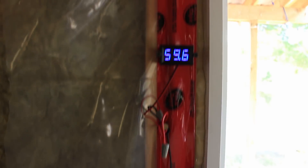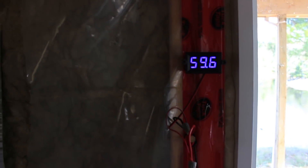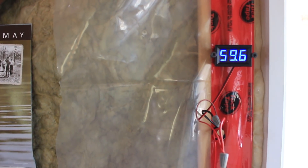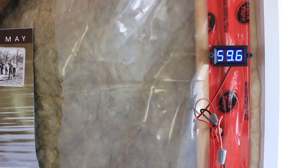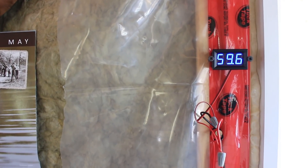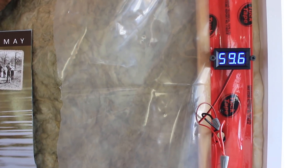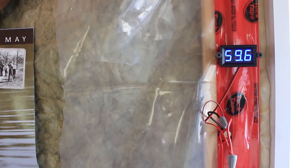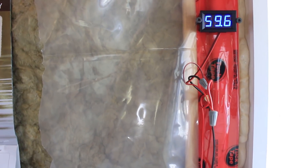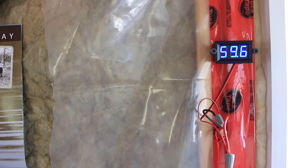One last thing I wanted to show you guys — I wired up this voltage meter I bought off Amazon. I got tired of running outside all day or all night just to check the voltage. Now I can sit here inside and see it. It's not the be-all and end-all of how your batteries are doing, but it's a good indication of where you're at and how much power you have left. We're sitting at 59.6 right now. The battery voltage will always show a bit lower than the charge controller voltage — the charge controller leads it, putting in a higher potential. At some point I'm going to use a little black box and make an actual nice little display unit here.